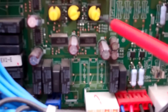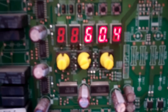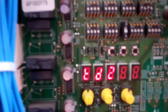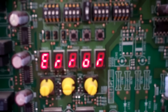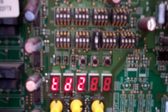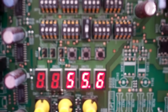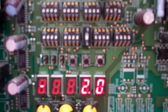We've worked out that if we turn these little switches, it tells us what the sensors are doing. That is TD1 — Discharge Thermistor 1 — at 60.9 degrees. And then Discharge 2, TD2, it's 55, 54... look at that, error. Error 29, it's all over the place. Did you see that? Around 58, 43, 20 degrees, 17, minus 2.